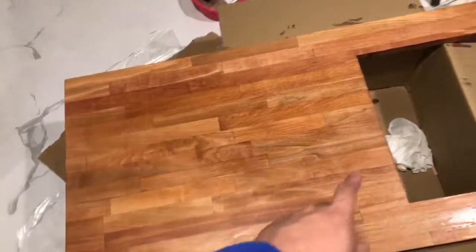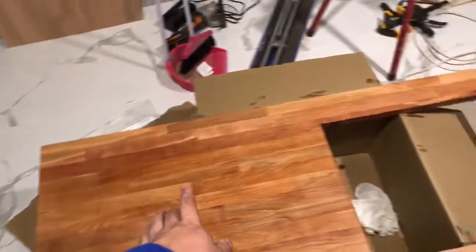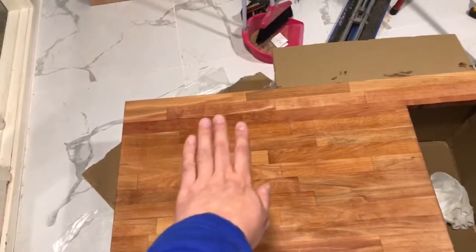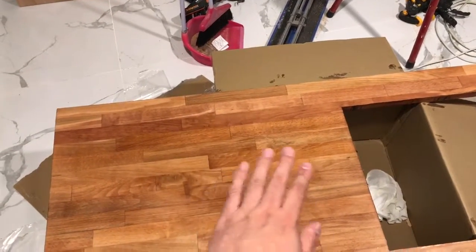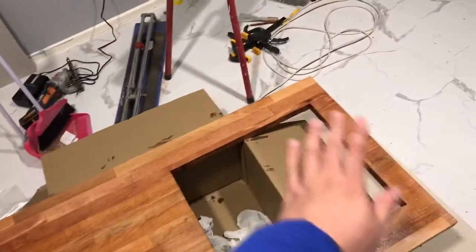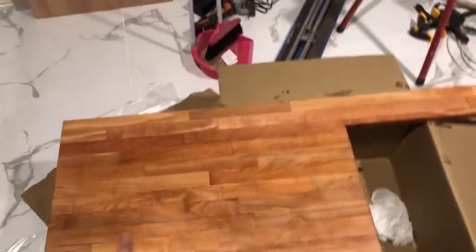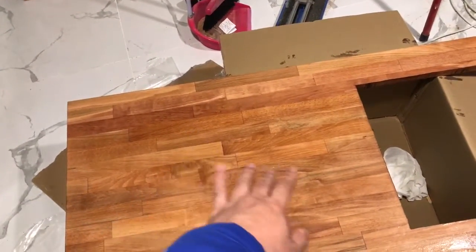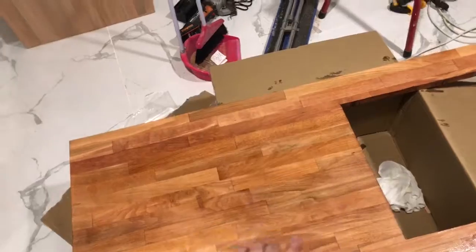What I did is a two-step process. First, I coat a very thin layer of epoxy, which is used to seal the porous surface. It's so thin that once a bubble comes to the surface, there is nothing covering it, so the bubble will burst itself. That's the first coat, and I waited 24 hours, and today I just applied another layer on top.